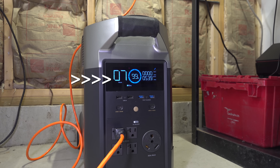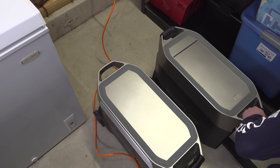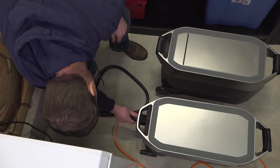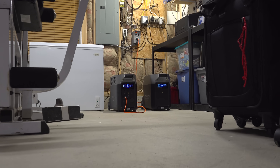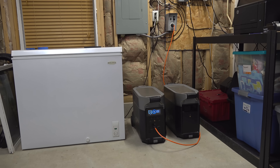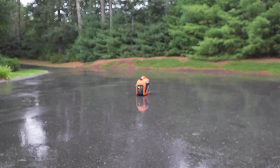On the display you can see it says this unit will run for seven hours, but you should actually see around 21 hours because most heating systems don't run continuously — for each hour of the day they might run for about 30 minutes or even as little as 15, depending on outside temperature. He opted to buy a second battery which connects right into the Delta Pro, doubling the run time. With a single charge on both batteries, you should be able to run the heat for almost two days. You can also expand with an additional battery tripling run time, or get solar panels to charge them up every day. If you expect outages much longer than that, you can certainly get a gas generator — just make sure you're maintaining the machine and have enough gasoline on hand.